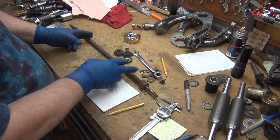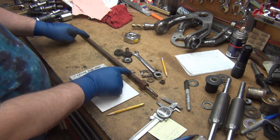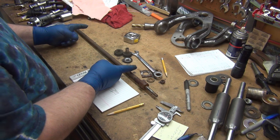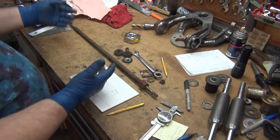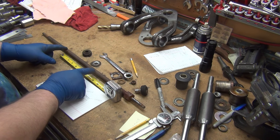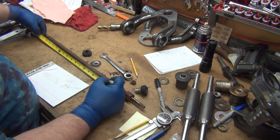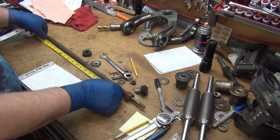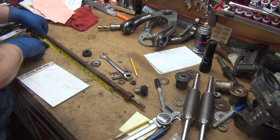Basically I just have to make two new end pieces, and they can both be the same — they won't need an adjuster nut or anything. I can put the five eighths inch thread on them, which cuts down a lot of the work and helps keep the price down. Those tubes, depending on exactly how long I get, I can put a seven inch one right in the middle — the seven inch one's under twenty bucks and it's three eighths twenty four. Taking nineteen and three quarters with seven, seven, seven — that puts it roughly at fourteen inches, so I can adjust around that.